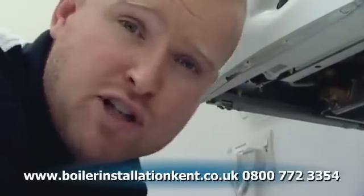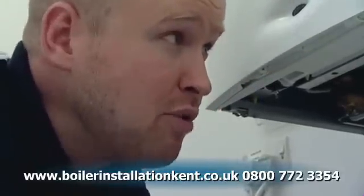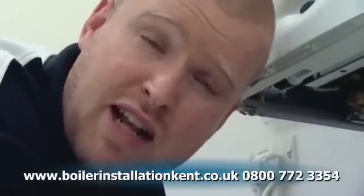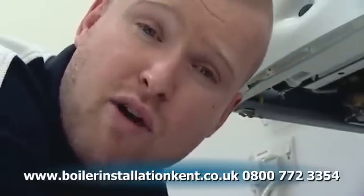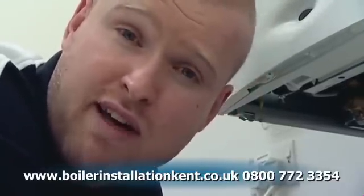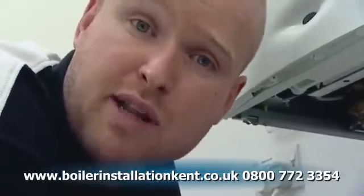Okay, so I've now repressurised the boiler, and I'm happy that the black needle is up in the green to the required 1.5. Now remember, don't panic if you do find that the needle has gone up to, let's say, 2 bar in the red. Don't worry about it, okay? The easiest thing to do is to go around your radiators and bleed a little bit of air. What you then might find you have to do, of course, is come back to the boiler and repeat the process.